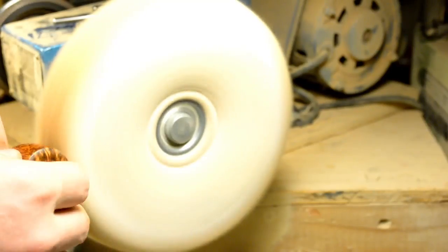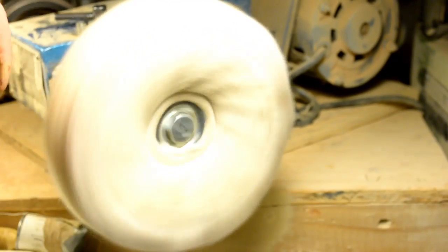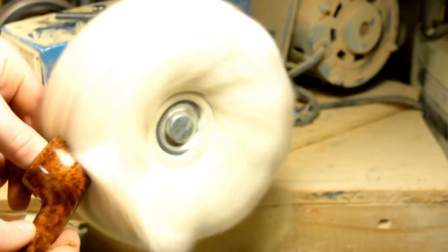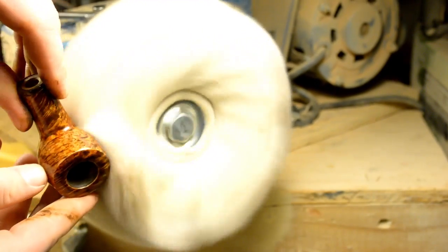After three or four days or a week depending on the piece of wood, we'll go back to the white diamond wheel and that's when the shine really comes out. Then again we'll carefully wipe off the buffing gunk — with a shirt or something — and then we'll go to the wax wheel, the carnauba wax wheel. That goes really slow, so if you have a 3600 RPM buffing machine you have to be really careful: one because it'll just grab the pipe and shoot it across the room, and also because wax can melt really easily.